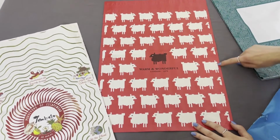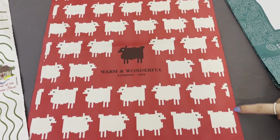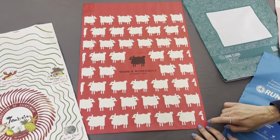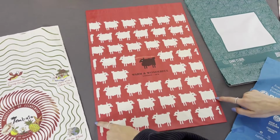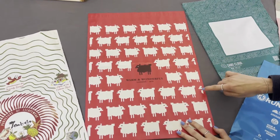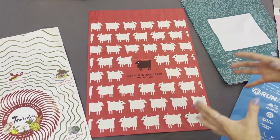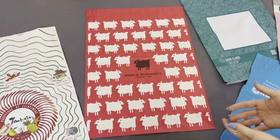And you'll notice that this design is covering the majority of the mailer, but it cuts off right here at the edge. And so that's where we would say if you want a printed edge, just one color, you can use one seam plate, and a seam plate will cover both of these edges. If you wanted to expand this pattern all the way to the edge, it is possible, but it requires a much more complex piece of equipment and a much more complex printing plate.